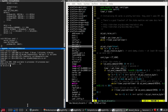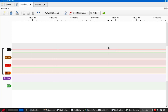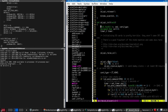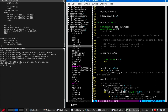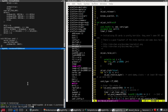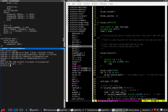Okay, I'm going to guess a timer interrupt doesn't work. Ugh. Okay. Wonder if interrupts are on at this point. Well, let's just do a busy loop. So the volatile int is to prevent the compiler from optimizing that away.